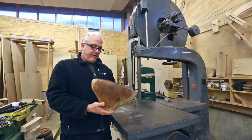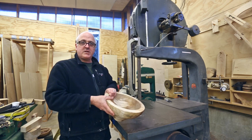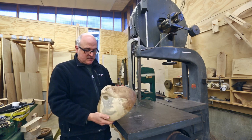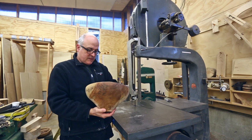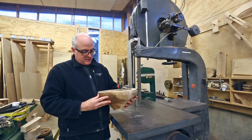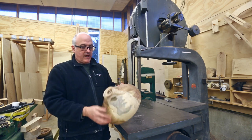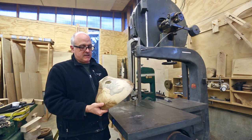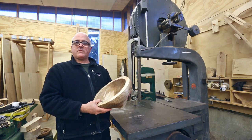The bowl has dried for a little over a year and it's in pretty good shape. It's cracked a little bit around the edge, but those aren't too bad. It's more that it's cracked on the bottom, and it turns out there's a knot — a branch that goes right through the center of the bottom. So what I want to do is slice out all these cracks and the knot, then rebuild a segmented piece to fill in that space.